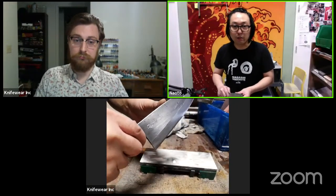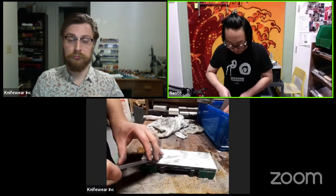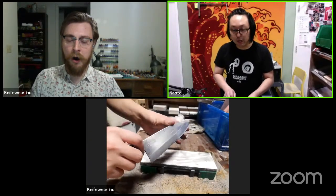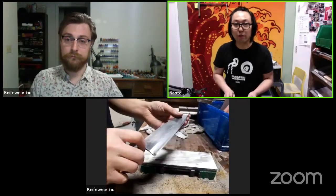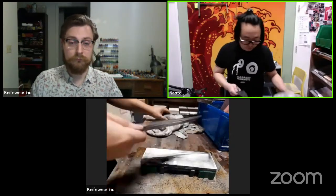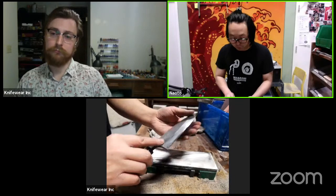Okay, so after I polish the bevel, that looks pretty nice here. I will put the last edge coat, the kobaru or micro bevel. Again, this is flat on the bevel. I will add quite a bit of angle to the knife here. Because the backside is flat, I give about 30 degrees or slightly more, and a few strokes. And if you sharpen your deba well enough, a few strokes like this will give a nice burr. Wow. Yeah. This is 4,000 grit that I'm using right now. 4,000 is good. It gives a pretty nice edge between sharp and smooth as well.